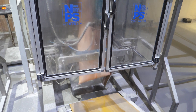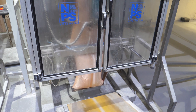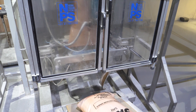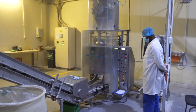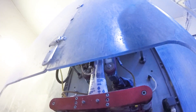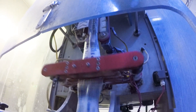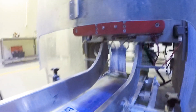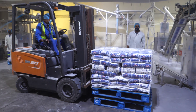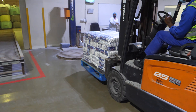In the modern packaging plant, the salt is put into 25kg, 1kg or 500g packets. These machines are known as form, fill and seal machines, as the packets that hold the salt are formed, filled and sealed in one automated process. The packs are put onto pallets by hand and are taken to a stretch wrapping machine to be encased in plastic.